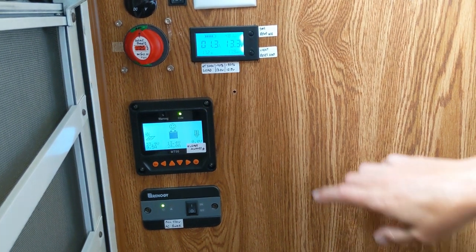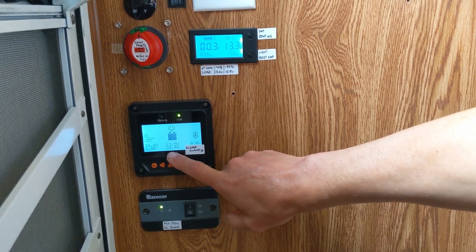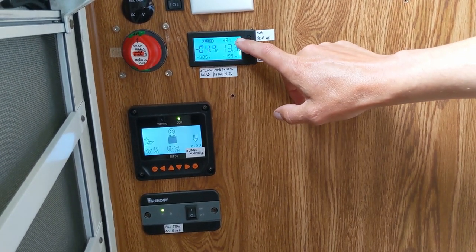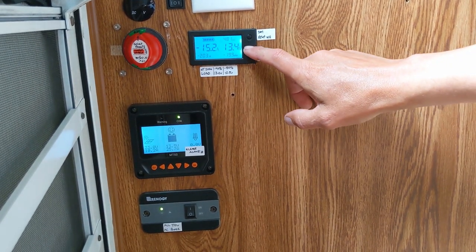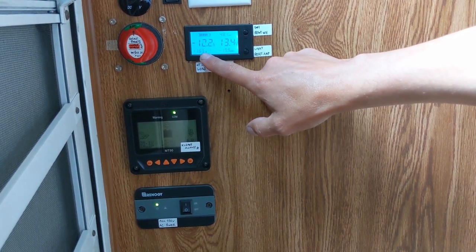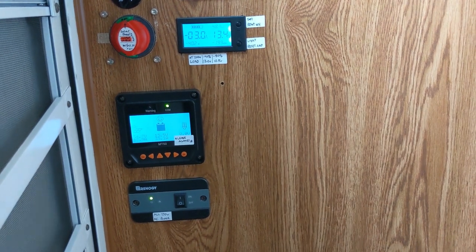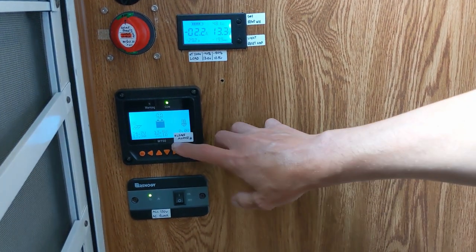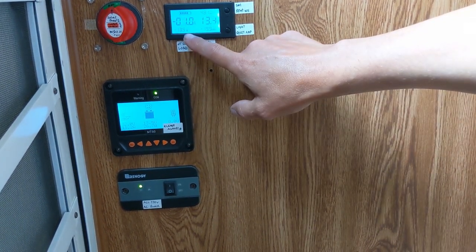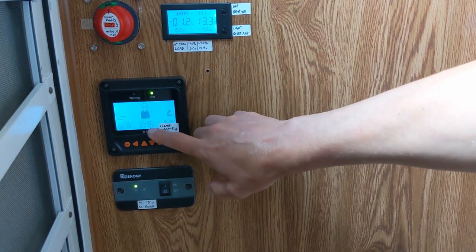The AC is running and you'll see on the consumption meter that there's really nothing coming in or going out — it's basically zero. Our charge controller is putting out 24.5 to 25 amps right now, and the battery is full. Our full capacity on this consumption meter is 500 — I set it for 500 because it's easier to remember. The charger is putting out 34.5 amps out of a maximum of 60, which easily consumes about 800 watts from our solar. That changes depending on what clouds are going by. So we're basically not consuming or charging much while the AC is running, but the battery is still completely full.